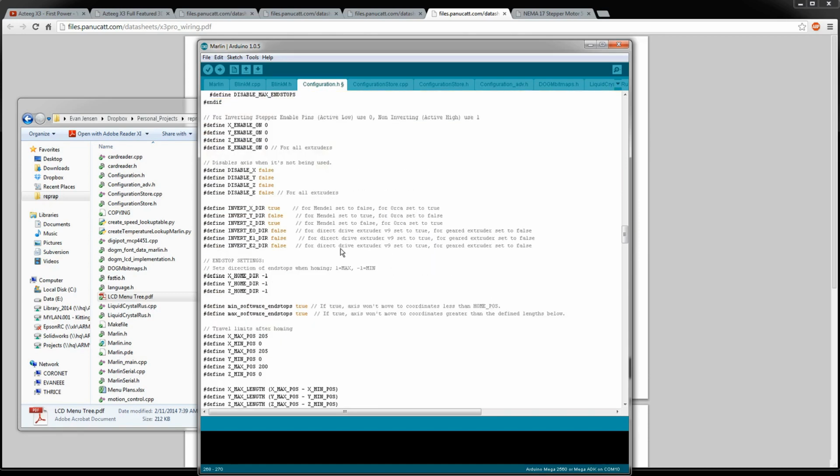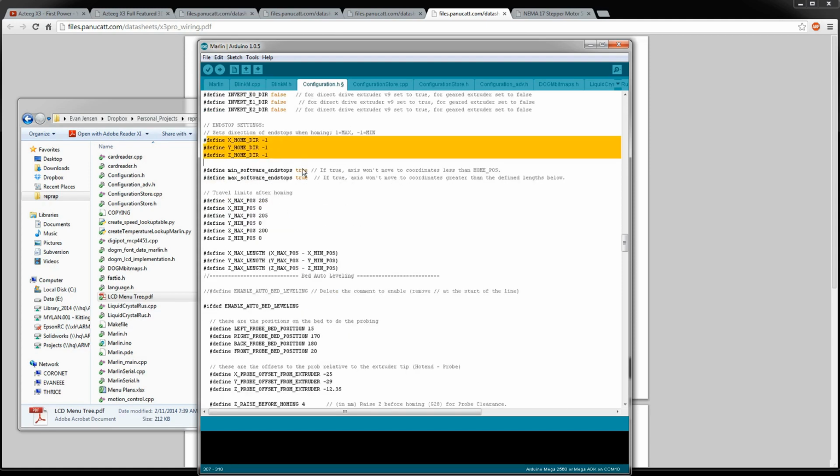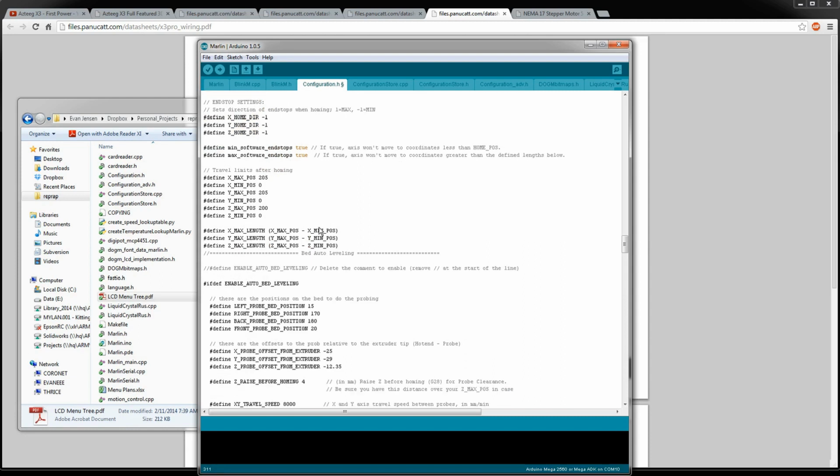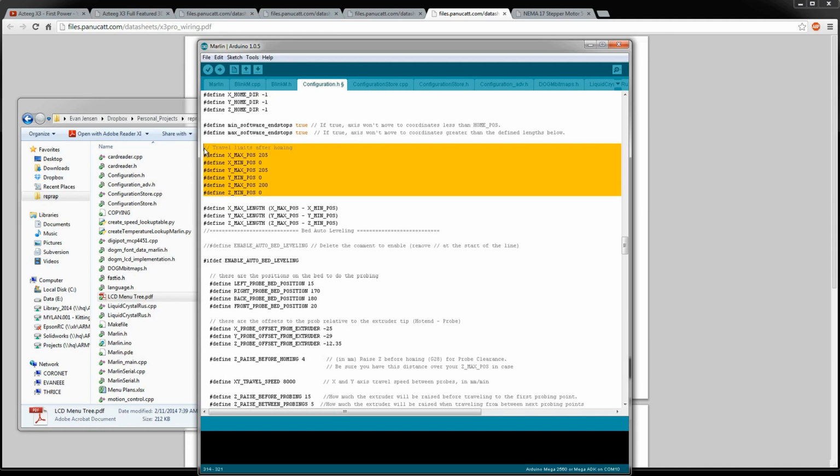End stop is all in here. Here's where you would invert if one of your axes is going the wrong direction. So Z invert is set true, X is true. So that'll switch the direction pulses. Whether the motors are disabled when they're not being used, how it enables them if that's a reverse polarity on that. Homing direction, which way it goes during homing. There are also software travel limits, which you would see in a servo drive typically, which is pretty cool.